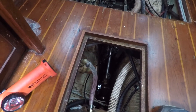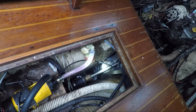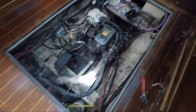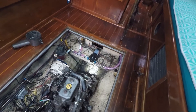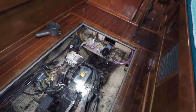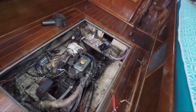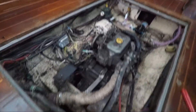Hopefully you can see the muffler down there — it's dark. Put some light on it and you can see the muffler. The only way to get antifreeze in there is to run the engine and let it fill up through the system. There's our fresh water system that was also winterized yesterday. So we've got a couple more finishing touches: drain the block and the water intake down there, as required by the service manual. I finally found some good information on that and that's what we're going to do next.